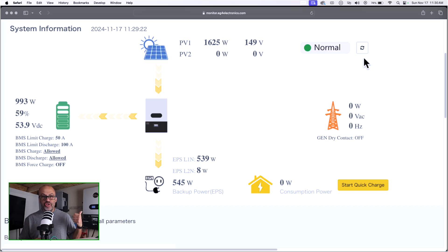I'm going to go ahead and turn this heat gun off and turn on the heater to show you that it's running on leg one as well. Got that one off — let's start the heater. Leg one is back down to about 500 watts. Starting the heater up now — it's saying 'hi' right here, at about 2000 watts. There it goes, it updates up to 2000 watts on leg one with this heater.